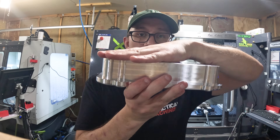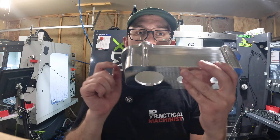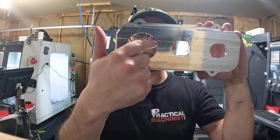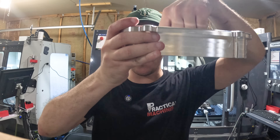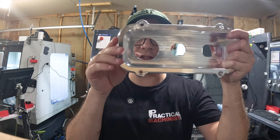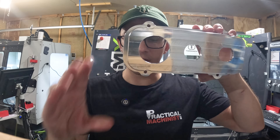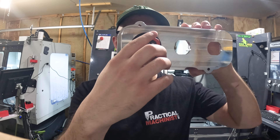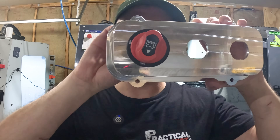So I did all this machining, flipped it, and did all of this. To locate, instead of putting a probe all the way down in this hole, I took this hole, did this geometry, and then I drilled the hole all the way through. So when I flipped it, I could pick up off that hole for X, Y, and Z. That was great. The only problem is this feature — while it's round and it's got two flats — is supposed to hold this disconnect switch and prevent that switch from turning. As you can see, that item turns. That's no good. Boo-boo.